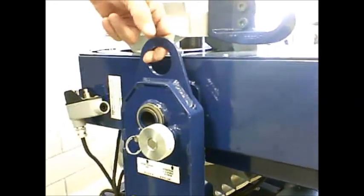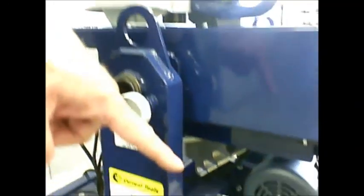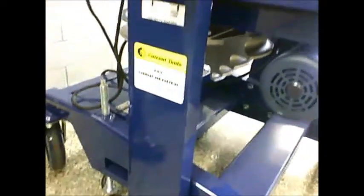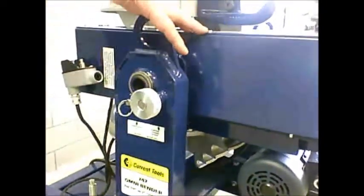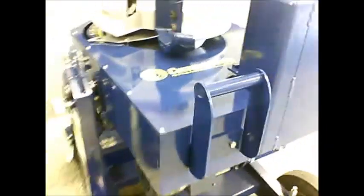You can sling it, or with the bender in this position, with of course your leveling screws, once they've been lifted, you can push the bender where you want it to go. Always do it in the horizontal position because you have much more leverage, and you also have this handle that you can push, and the shoe will be pointing up.